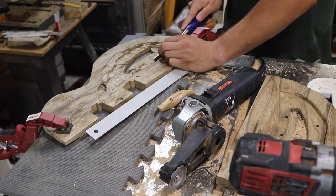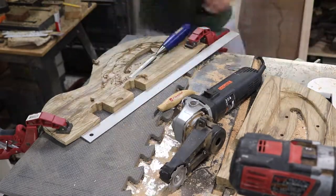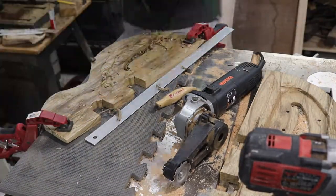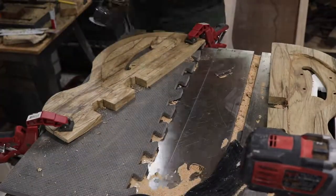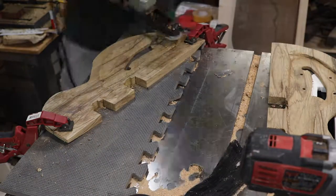After I finished taking the bulk of the material out of both pieces, I carved out a straight edge with the chisel. I then sanded out the two cavities to get rid of the markings left by the Forstner bits.